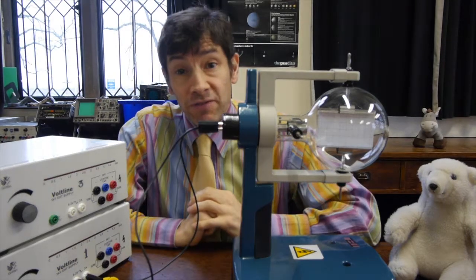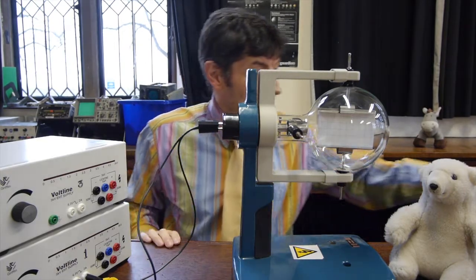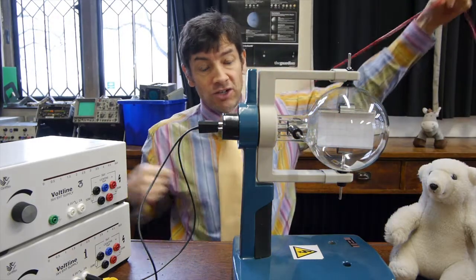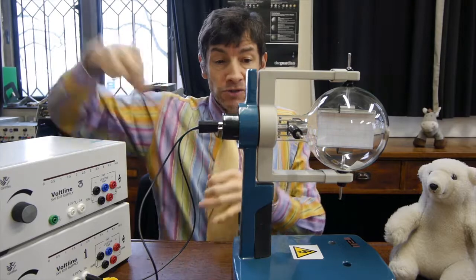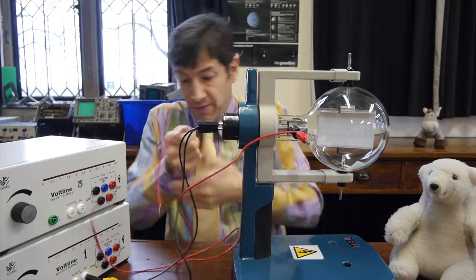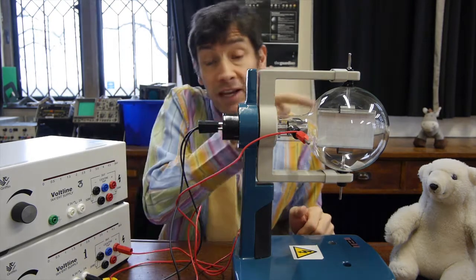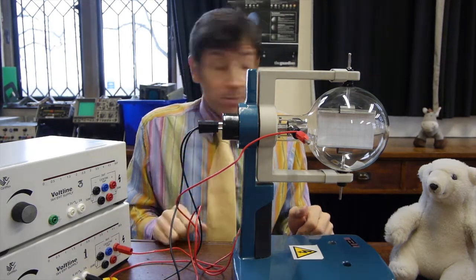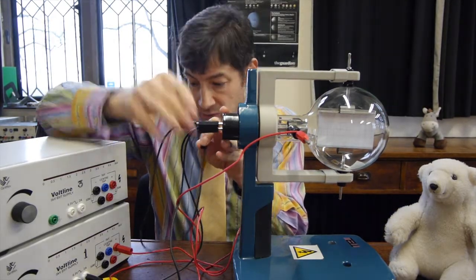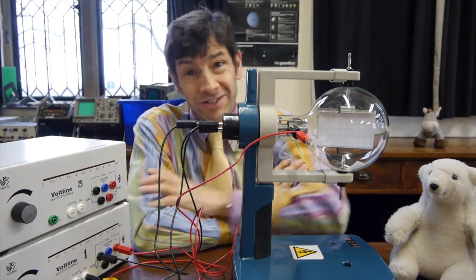The only purpose of that is to pass current through the wires and get that filament really, really hot. Electrons will boil off that filament, and if I get those electrons and put them near a very positive anode, I'm going to put a positive wire here and connect that up to the positive of the power supply. They will be accelerated across this gap. But to encourage them across the gap, let's make the filament side negative. And when I turn on the power supply, we'll see the electron beam.